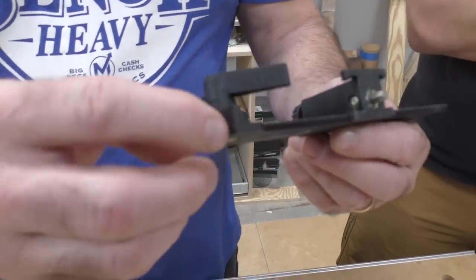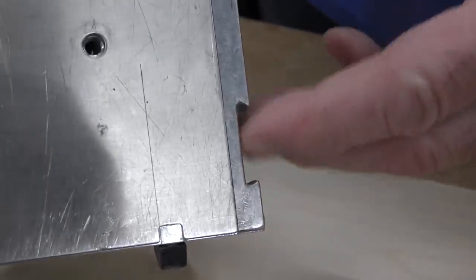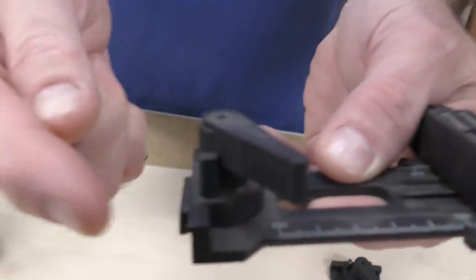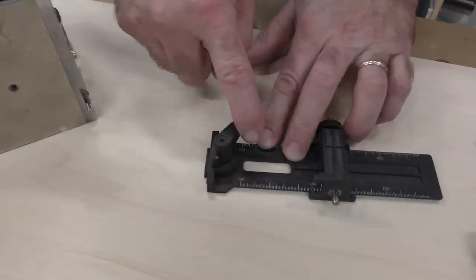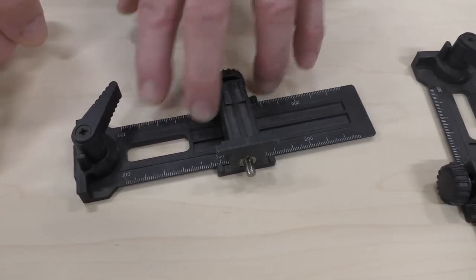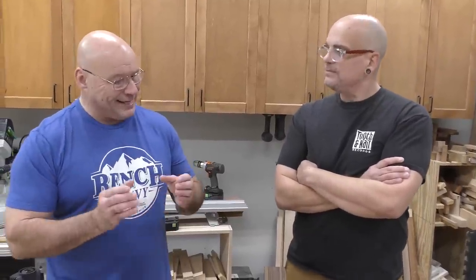There's a little dovetail — see the little tail here? There's actually a pin right here in the base. When you look at this and you see this little lever pointing forward, see how it's loose? When you put it on the base, you tilt it back so this is never in the way, because you have to utilize this pin. This pin goes into the mortise. So in other words, you don't have to mark the boards. It's designed for one thing: ease of assembly.